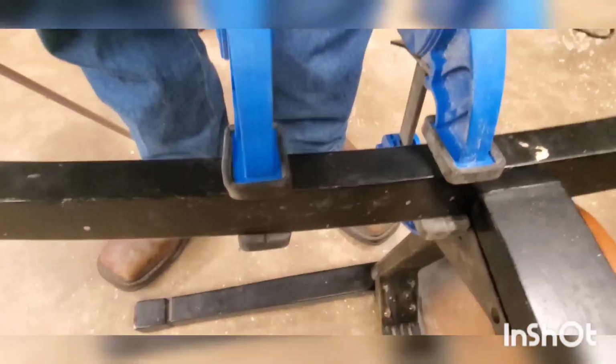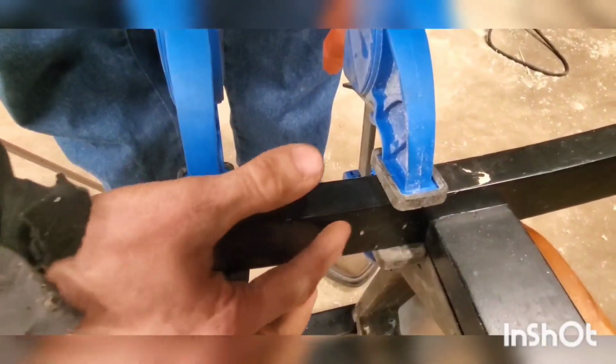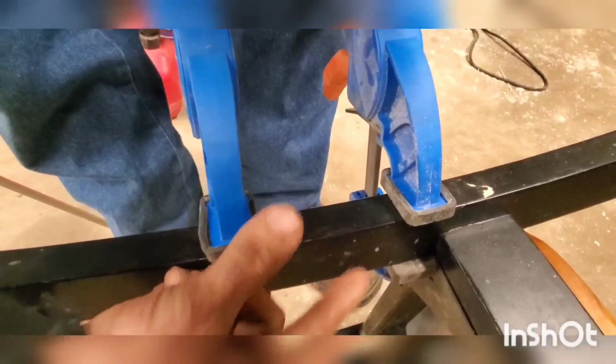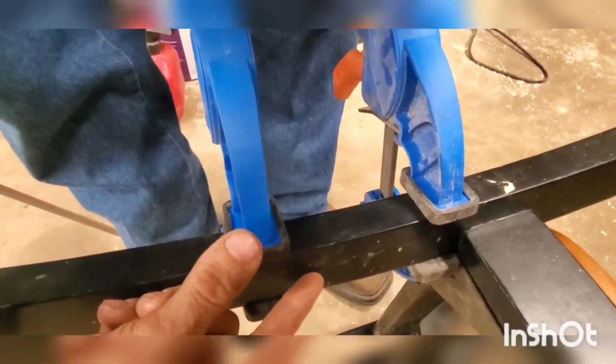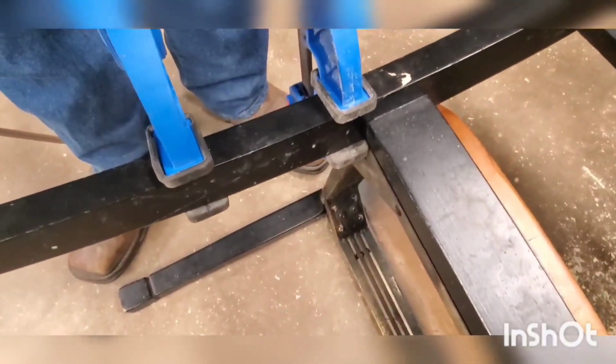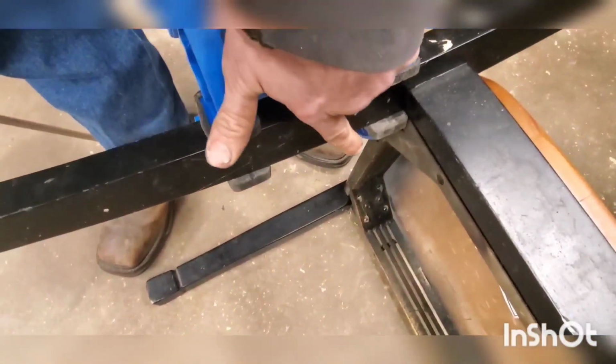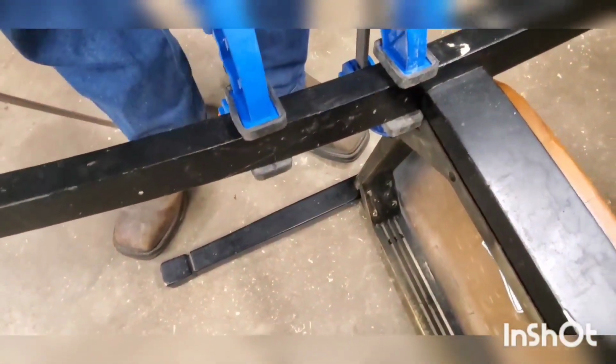All right, so here's your crack along right here. I'm going to come in on an angle with a dowel pin and another dowel pin right here. I'm going to use oak, so it's a strong piece of wood that I'm going to put into hardwood. So I'm going to drill on an angle and then put some dowel pins in.